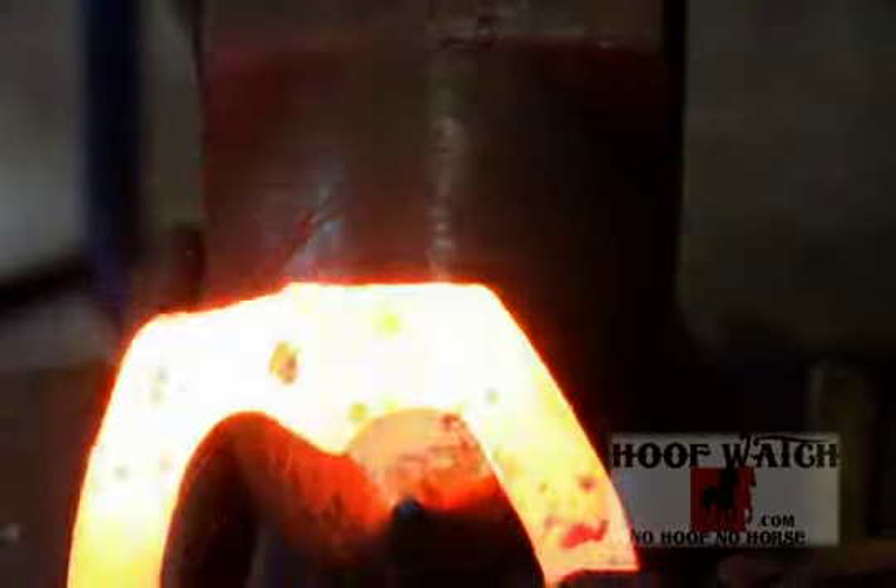Once I'm back to 5 sixteenths, I come up on the horn, hit the weld, hit the weld, hit the weld, drop down, hit the outside corner.